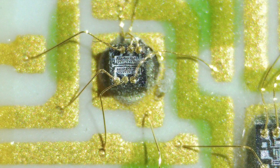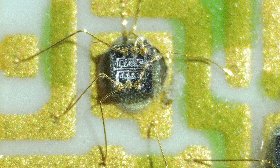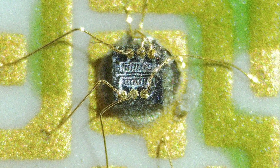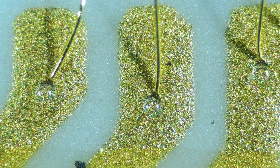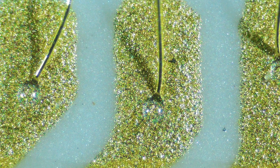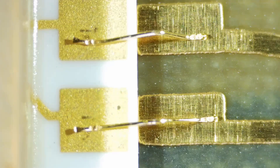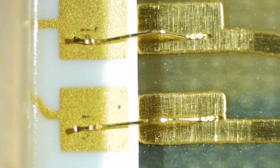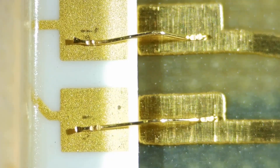The smaller chips look like they are just made of 2 transistors — they have 3 pins on top and 3 below, so maybe 2 transistors. Those are the tracks on the ceramic substrate; it looks like someone printed gold dust on the ceramic. And then these jumper wires are welded from the ceramic chip to the PCB, which also has gold tracks.